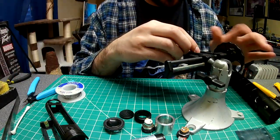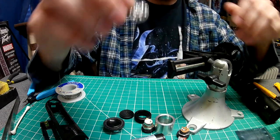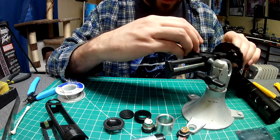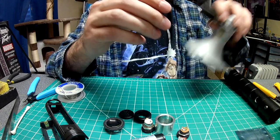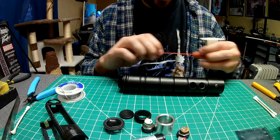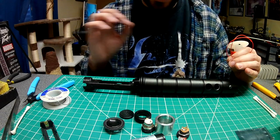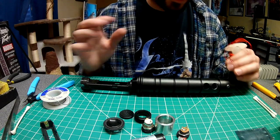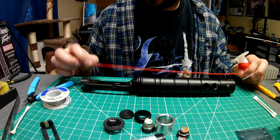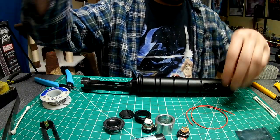Much better — that's how you want it. Now, if you're wondering how long to make the wires, it's easy to figure out. I'm going to measure down to the board, make it just a tad bit longer, and then use that as my template. Snip it, there's my template. So I'll get my black wire.